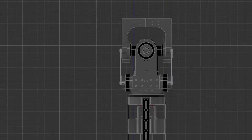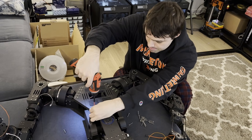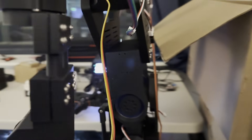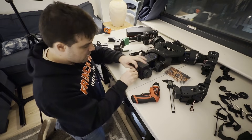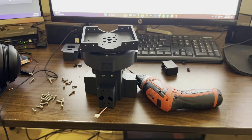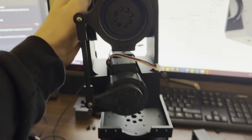The original design was mostly fantastic, but there were a few changes we wanted to make it easier to manufacture. The first is the original arms were held together by friction, so we added screws so they stay in without falling off and breaking. The second is the bottom of the torso was very difficult to screw in because of the orientation of the screws, so we designed a square plate so we could drill the screws into the side.